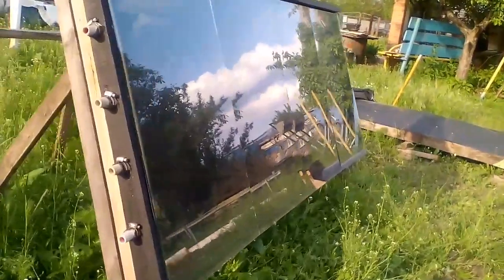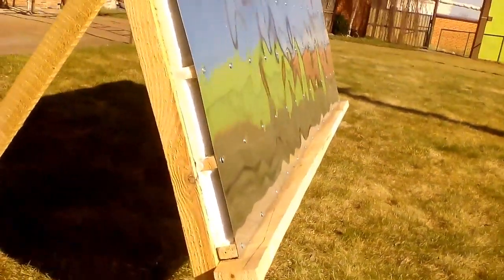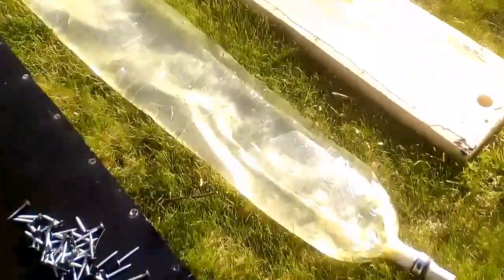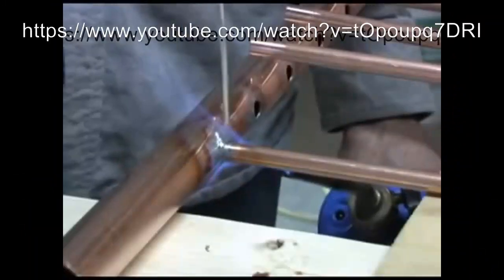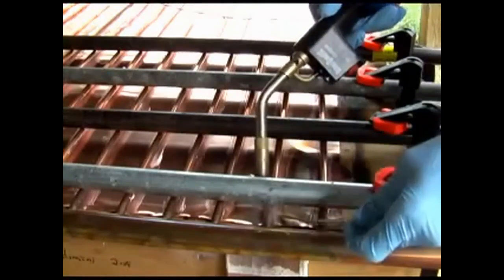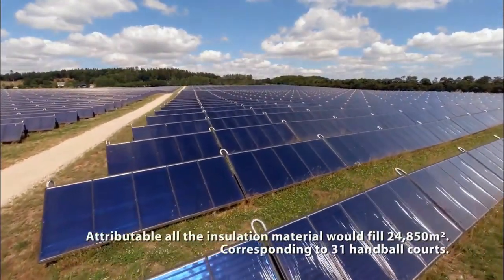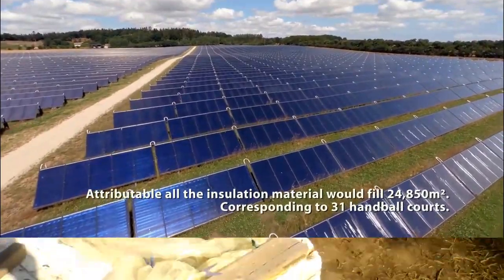This cheap solar collector was made by me according to a different design, and this thin steel sheet is heated by the sun and gives the heat to water which will move along these holes within a similar polymer sleeve. Such cheap polymer sleeves replace those expensive copper pipes which require laborious connection with each other and with that dark copper or aluminum sheet, and these facts affect the profitability of such large solar stations designed to produce a huge amount of heat cheaper than heat from natural gas or other traditional energy sources.